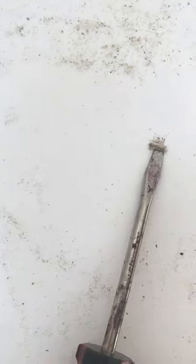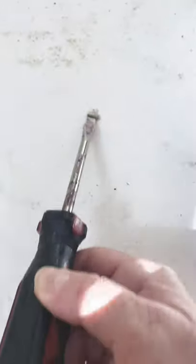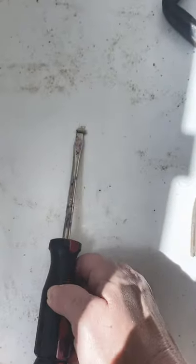I've removed all the carpet and now what's left are these little tacks that held the carpet down. We're going to put vinyl plank flooring, so they stick up enough that you're going to want to remove them. I'm going to show you how I do that — wedge the screwdriver underneath it and then hit the back with a hammer so I can get it up off the ground a little bit.